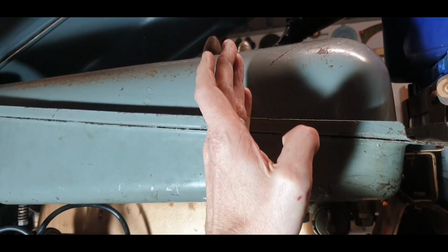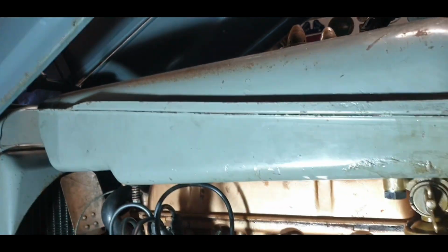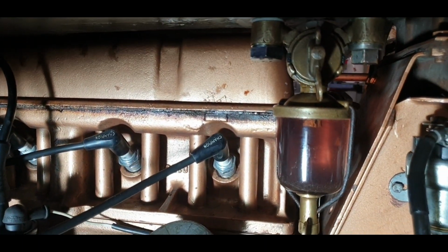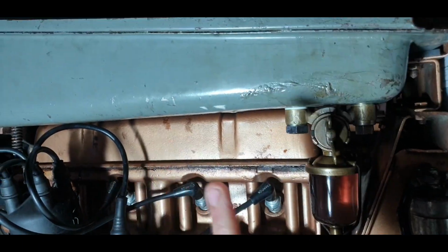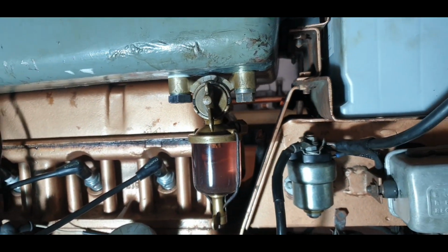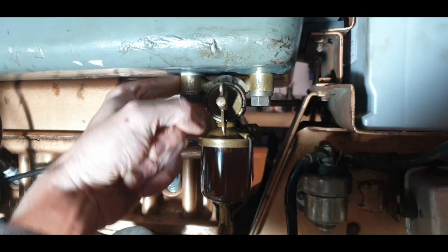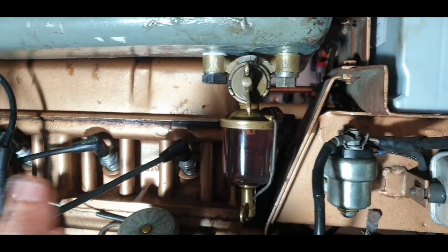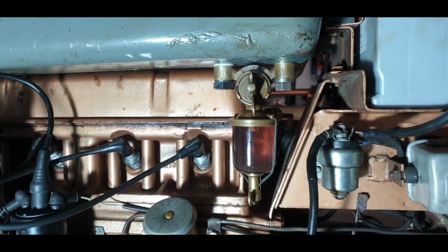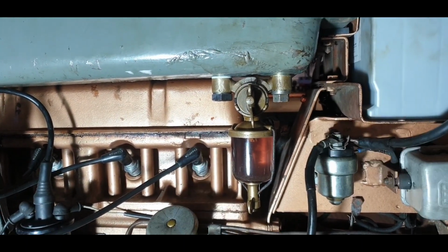It's important to keep the petrol tank separate from the TVO tank. Otherwise, you'll have to run this engine on petrol the whole time, and it's just not designed to do that. So it's worth trying to salvage this, keep it useful. And yeah, we will come back. I'll report back when I have a little bit more to show. We'll see how this seal and washer works. And yep, so the next time, hopefully, that is going to have sorted.